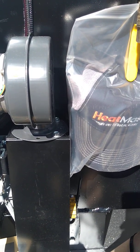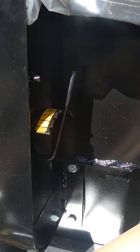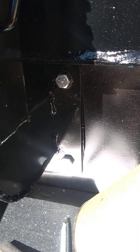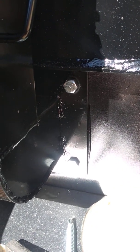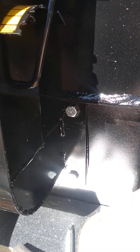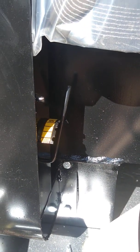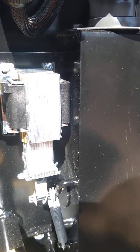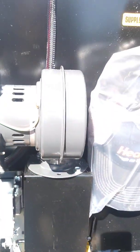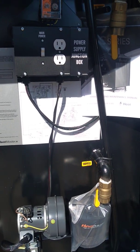I've seen ash or grit get underneath the flap and stop it from dropping all the way down — and it sucks air; it doesn't take much of a crack at all. I've also seen a few cases where the flange meets the back of the ash pan — you can see where silicone has squished out to seal it — and if someone removed it without resealing, you can get air leakage there. But that's not real common and would start immediately after reinstalling without resealing. If it's abruptly changed, I'm checking the solenoid and the flap to make sure it lands tight.